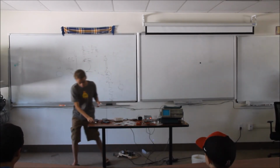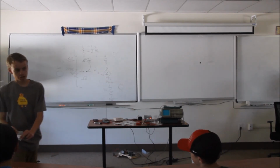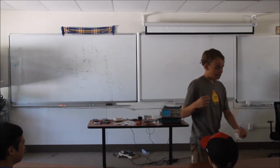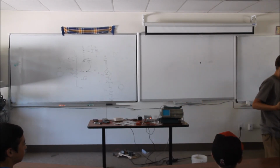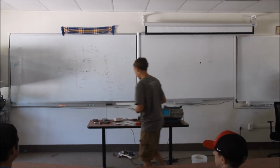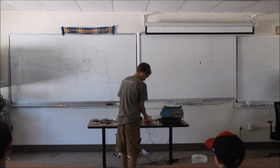Now, if you look at these resistor packages, you see that it says 1/4 watt on here. And that's how much heat these resistors can dissipate, because there's that much current flowing through and that many electrons bouncing around in the resistor to make heat. And if we put over 1/4 watt into this resistor, then it will get hot and it might catch on fire. So we're going to hook that up to see what happens to this resistor.